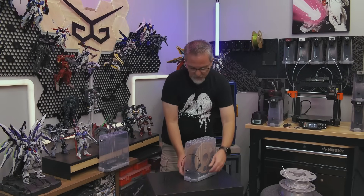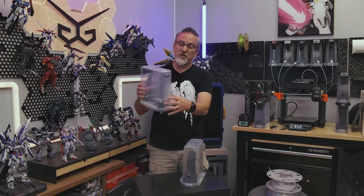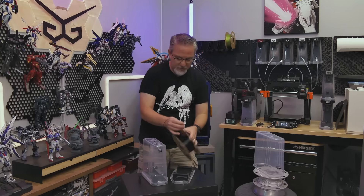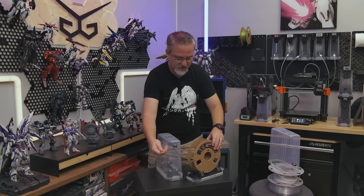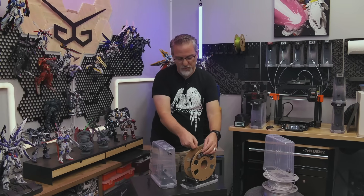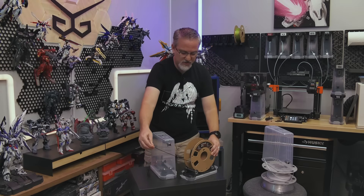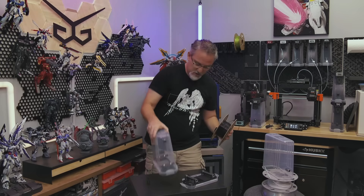That is the basics of the new system. A couple of things I like about this as improvements over the old system: first, on the old system, the outlet for the filament was up top. Especially when you got down near the end of the spool with filament coming off the top like that, it would have a tendency to get pulled up off the rollers and run into the front of the container. Several of you had reported that as an issue, and I noticed it as well — especially with these lighter-weight cardboard spools when they started running out of filament. Now we're running this off the bottom, so the force of pulling out is always going to be pulling this down and against the rollers, which has really solved that problem of almost-empty spools causing binding issues.